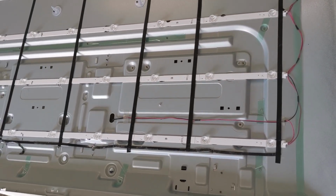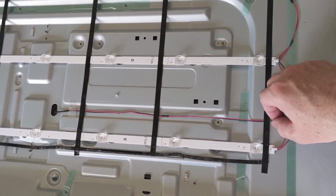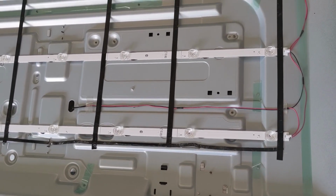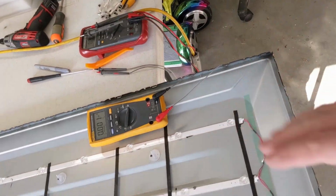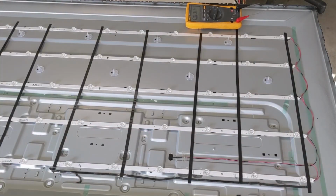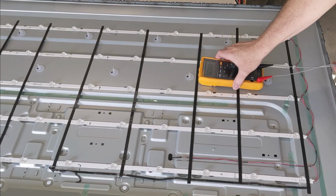So I'm going to put my camera on the tripod and we're going to do some troubleshooting with this. We know that open circuit, we're around 200 volts. Plug it back up, we're getting about 170 volts, which is probably current limited. I'm going to bring my 2 meters over and we'll look at troubleshooting it just a little bit for the backlight. A little bit of a weird angle here, I apologize, but just to get both meters in the shot, I hope.